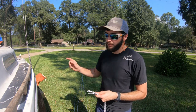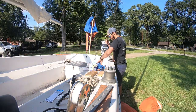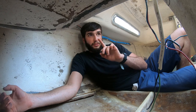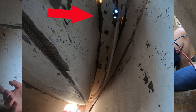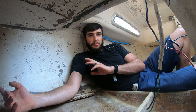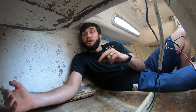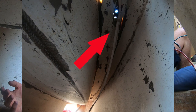I'm going to feed these through the back blocks, then crawl up each side and cap off any hardware that might interfere, then feed it back up through the front block going to the winch. The spinnaker sheeting system on this boat was set up with a below-deck block. The line goes to the transom, down into the cabin area, up forward, out of another through-hole block, and back to the winches. That allows you to adjust the sheets from the forward part of the cockpit while having the spinnaker sheet as far aft as possible.